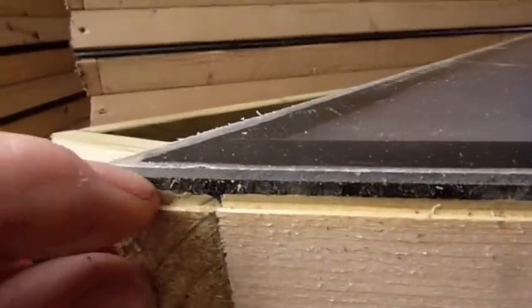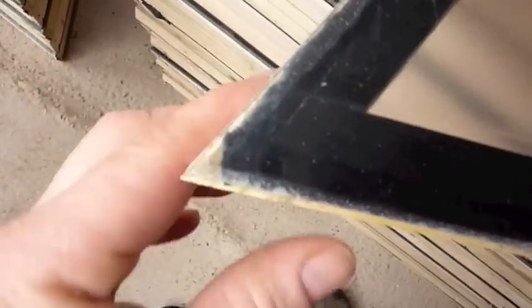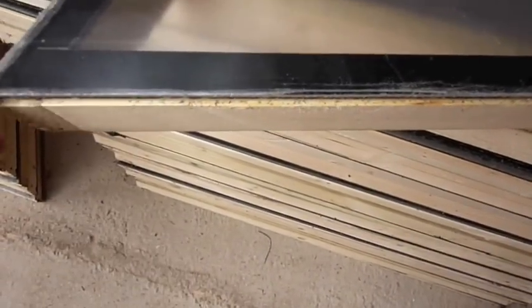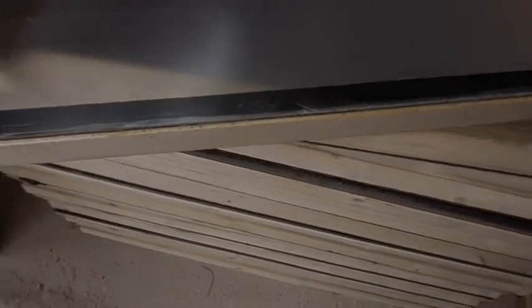What this does — I'll show you one that's been done — is it takes a little tiny notch out, but it also evens up the polycarbonate. So it's about a millimetre and a half smaller than the wood frame. And when we join the wood frames together, that will leave a little tiny gap to put the silicone down. I'll show you that in a minute.